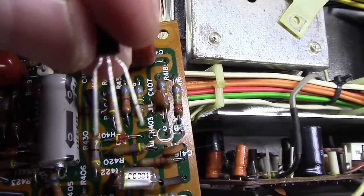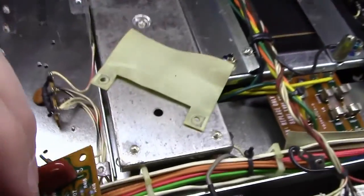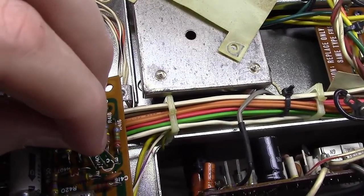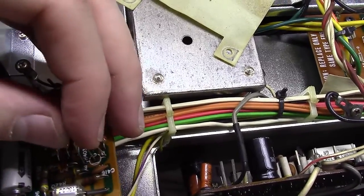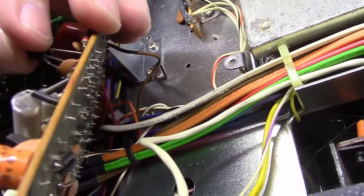I've written a little pinout here — emitter, collector, base — so this will go in here like this. I go ahead and spread the wires out so that they fit right in these little holes here. Once I hold it up, I flip it on the other side and do some soldering to get that thing soldered in there.